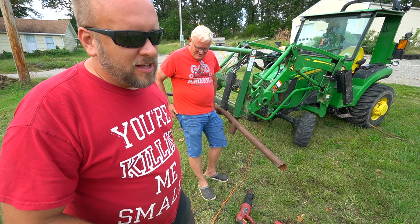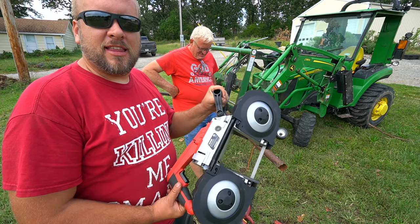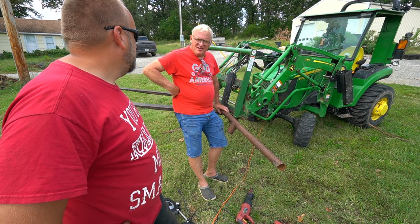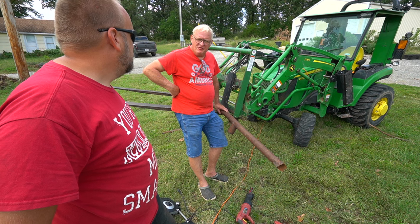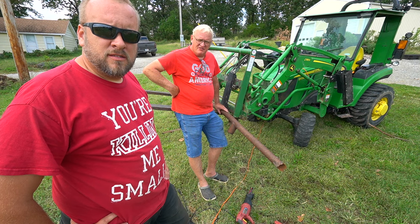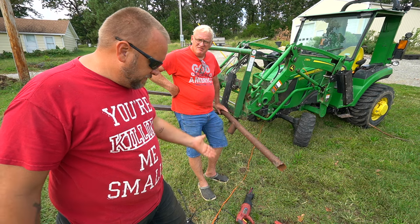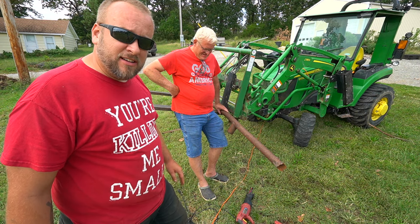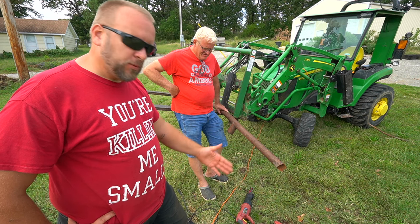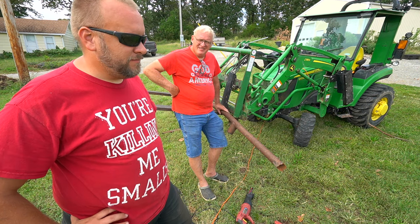Each tool has different purposes, but for this, this is a winner. I'm putting a link in the description to save you 5% off this portable bandsaw. I think the reciprocating saw would be a second choice because there are so many places you can't get a bandsaw into — cutting off the head of a bolt or something you're taking apart. It cut better than the grinders. If you have thin metal and need a long straight cut, then the best tool we've shown is the circular saw. But it did not do well for this, and neither did the grinder. The reciprocating saw is great for tight places, and for a chop like this, that bandsaw is great.